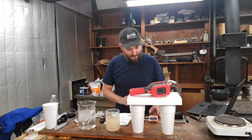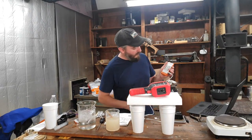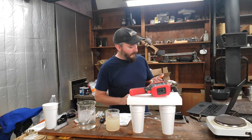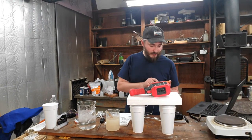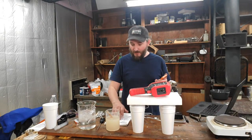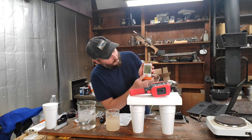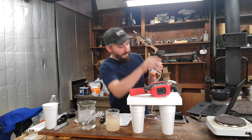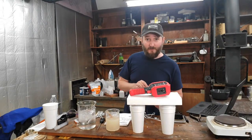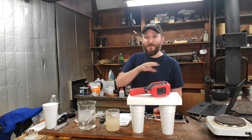So now I'm just monitoring my temp readings here, and this isn't going to tell me much really, because the current temperature change is not compensated for how much of each material we have in here. Currently, I don't know if you can see that, but we have 59 degrees Celsius in this container and 71.6 in this one. So more than a 10 degrees Celsius difference. So it looks like the phase change material is doing much better than the ice currently.